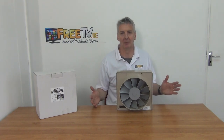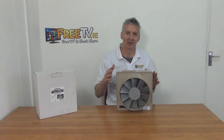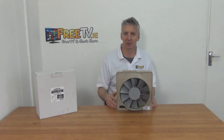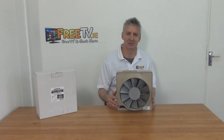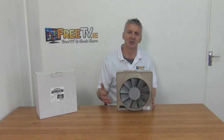Within the range of extractor fans on the marketplace, 4-inch fans are normally used in domestic applications, 12-inch and larger for commercial or larger office spaces, and the 9-inch here is a reasonably popular medium-sized option — suitable for a medium-type scenario.